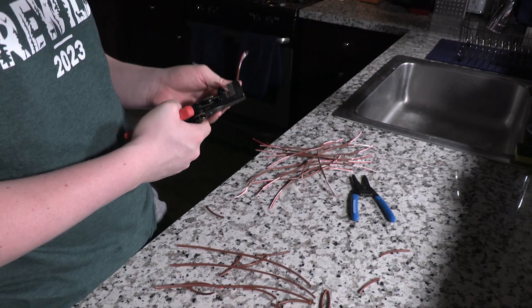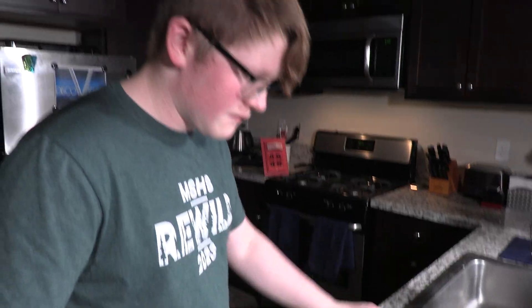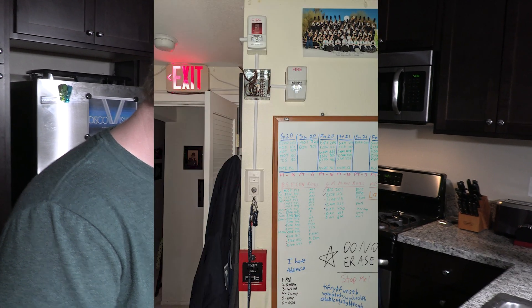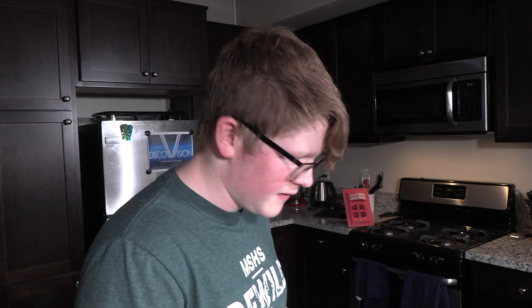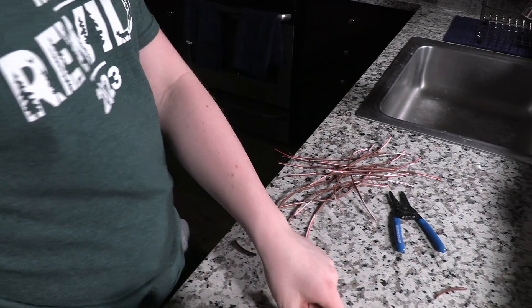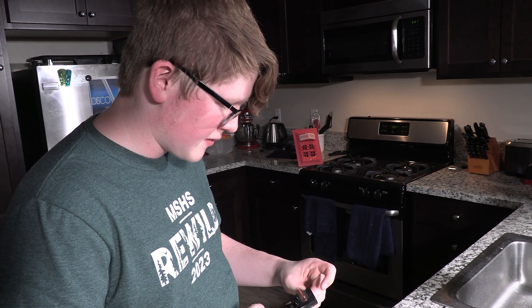The particular type we're using is 18-2, so it's two-conductor 18-gauge wire, which for most purposes is fine. You can also get it in 18-5, which has five conductors. That's what I used to use on the old system we had in Fire Alarm Friday. And if you've seen my system tests in my basement, all of that uses thermostat wire too — the expanded section in the pantry is the only part that actually uses FPLR, but all the rest is already behind trim boards and I can't replace it.